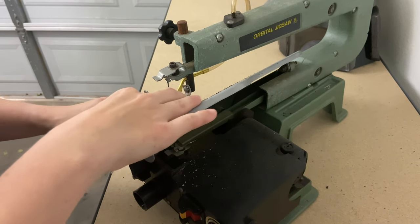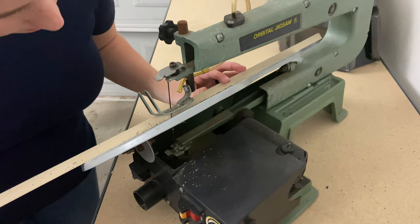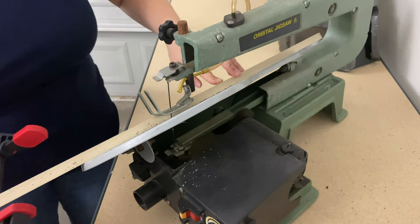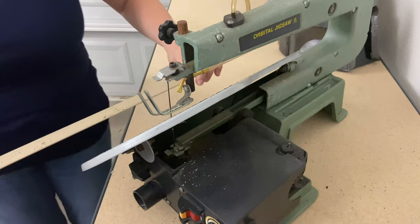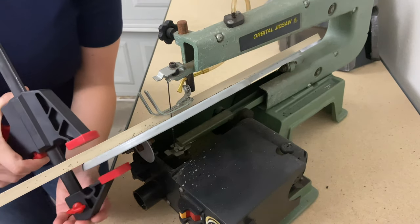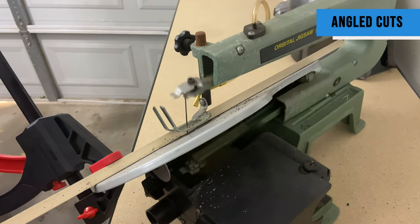I use the foam that I'm going to cut as the spacer. To make sure that my foam is going to cut at that angle every single time, I clamp a piece of lumber — you'll see that stick right there — it can be any kind of lumber; this happens to be a square dowel I had in stock. I clamp it right to the build plate, which lets me set it up fast and take it away when needed. With the clamp ready, let's cut a bevel.